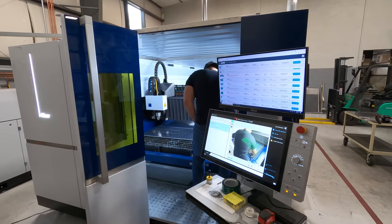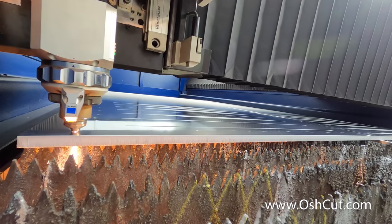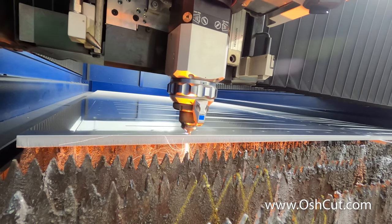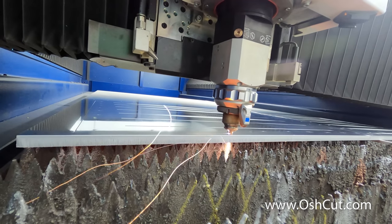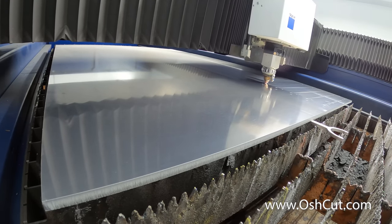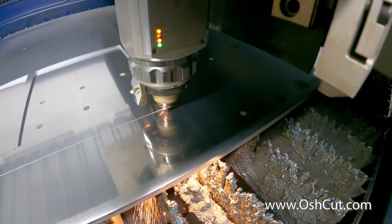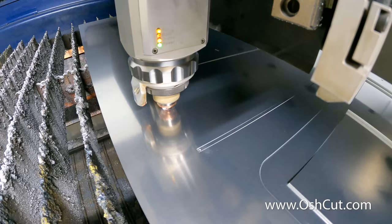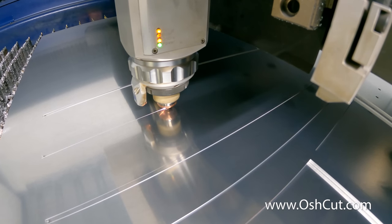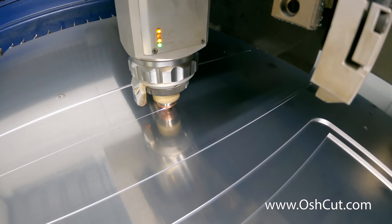The metal box that's going to hold all these batteries is rather complex, and of course we're going to build it with lasers. It'll make more sense as you see it completed and everything's assembled, but long story short, we're going with a triple box setup, each with a sandwich design. Each of the side boxes will hold 7 modules, while the center box will hold 4. The top and bottom pieces are laser cut out of half-inch aluminum, with little slots for each of the modules to slide into. The top and bottom will then be securely held in place by aluminum sides, which are welded. And the whole thing will be made watertight with the thinner plate screwed into the top and bottom with some waterproofing adhesive slathered on the seams.